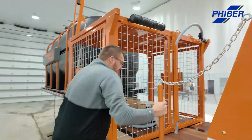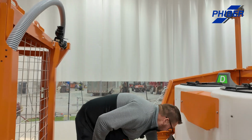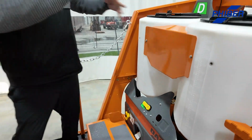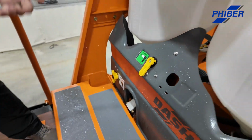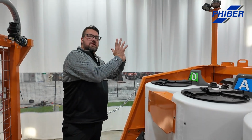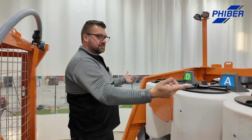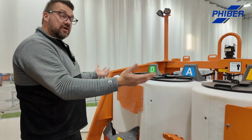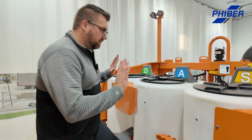Now, if you want to clean these things out, super simple. This also would apply for like winterizing. What you would do is normally you would have your rinse source, so that air diaphragm pump in the back is normally set to fresh water. So you're rinsing with water from your tanks. What you can do is turn on your water agitate and fill this inductor with water, fill it to like 35 gallons or so, and then you'd shut that off, turn your rinse source to D. You would then throw your cleaning agent in here, and now you go and pull all your handles down, and it's going to activate that rinsers in every tank, and because they're all open, the water is all going to flow back to this inductor, and you can just let it wash for as long as you feel that you need to. You want to let it wash for half an hour or just a few minutes, whatever it is, you can do a really quick wash.